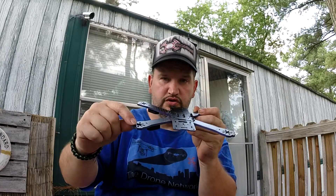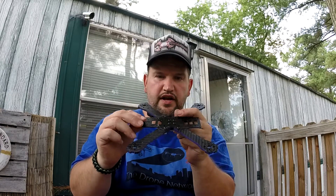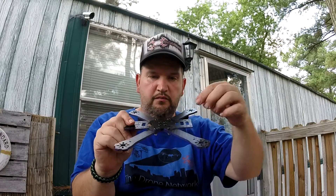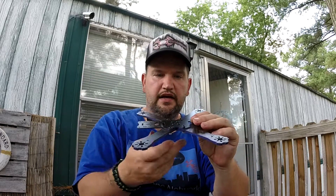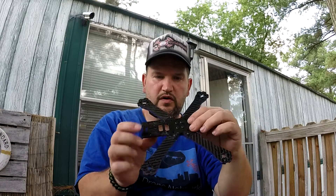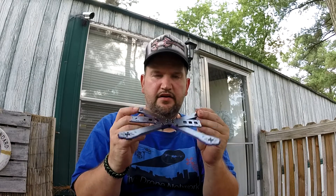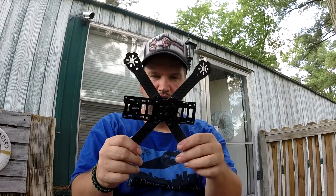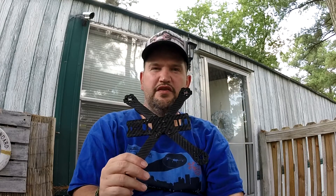Motor one, two, three and four. When you turn it this way, you're now going to have motor one, two, three and four in the new orientation. I'll take out these standoffs and screws, put new standoffs in, and print a hood thing — I'll have my flight controller and everything in the middle. So I'm going to lose all of this extra material, making it lightweight, and you don't have to keep buying top plates. The arms are four millimeter so they'll take a good hit.